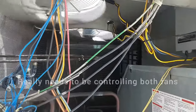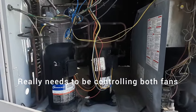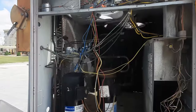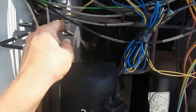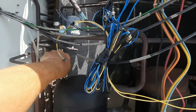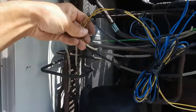There's the other fan from the motor master. Compressor's kind of loud. We know everything works, so let's get rid of our shorts and we ought to be all right - well, as all right as this thing can be. I still don't know where this sensor was. Typically you'd think it would be on the liquid line. Let's try to get that mounted on the stage one liquid line - it just had a wire tie that had broken.